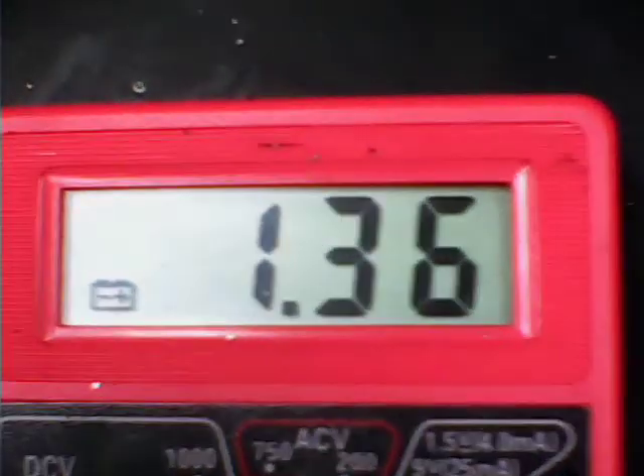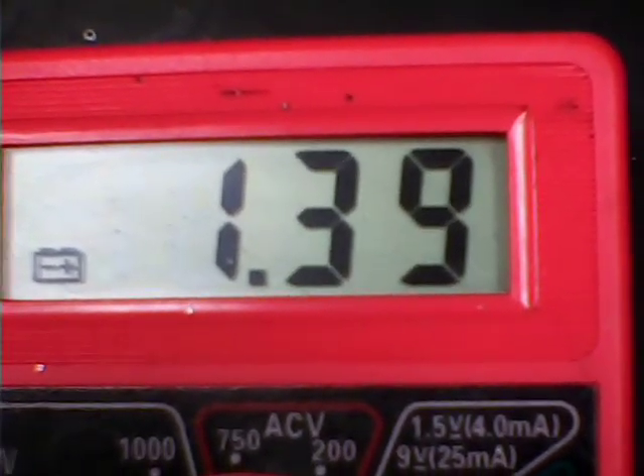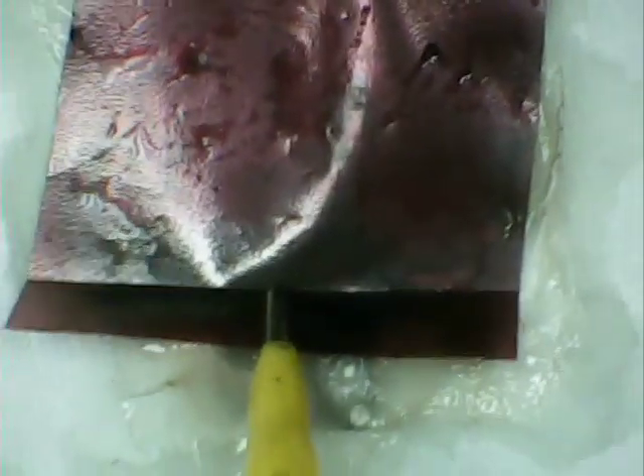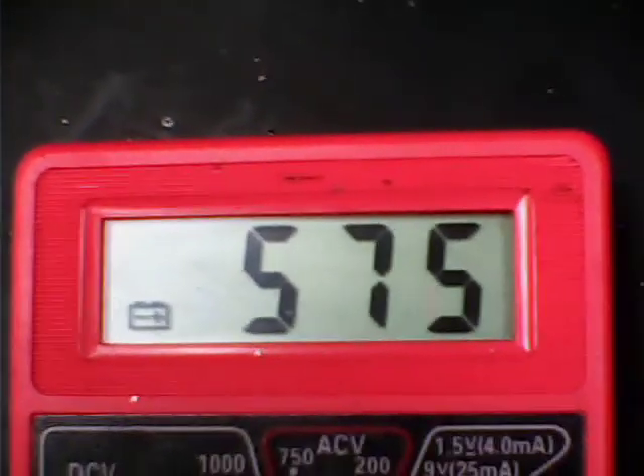Let's go back to the open voltage after the short and see if it rebounds. There it goes — it will make its way back to where it was, going up. I'll work on getting some air in there, because we want oxygen flow. I'll put some perforations in the conducting graphite electrode current collector. But my main goal right now is the production of ionic-conducting thin film membranes that can serve as solid electrolytes — I have some ideas in mind, but we'll use this for a basis of comparison. We're at 1.42 volts right now. Let's do a short — and there we are, right back around where we were. Thanks for watching, guys. Bye for now.